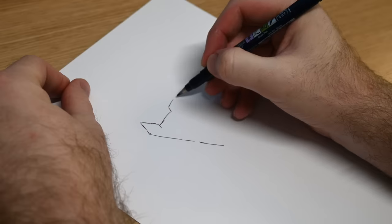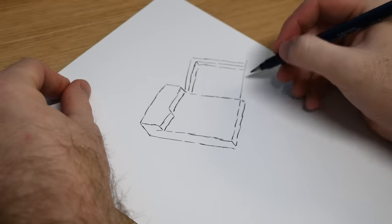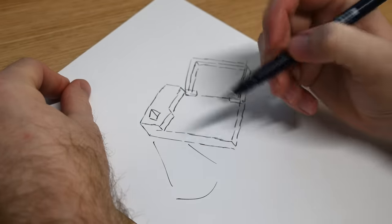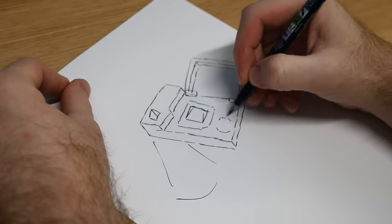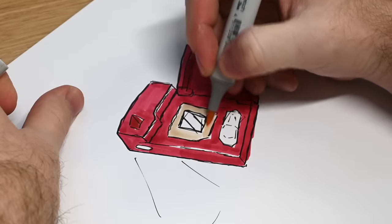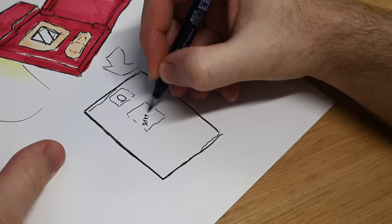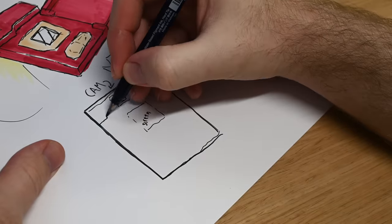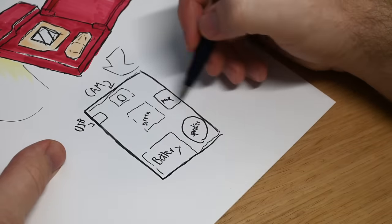We know the dimensions and form factor are going to be pretty much the same as the cartoon, so we can take inspiration from them for the case design. I'll simplify the design a bit, add a hole that goes all the way through as a viewfinder so you can aim it at whatever Pokémon you're trying to identify. We'll add a screen inside a bezel and a couple buttons. I'll print the majority out of red filament, and then the bezel and buttons will be done in beige. On the inside, this case is going to hide a bunch of electronics — the screen in the center, the camera up top facing towards the back, a USB port on the top left, a speaker on the bottom right, the battery on the bottom left, and a small board to drive that speaker.